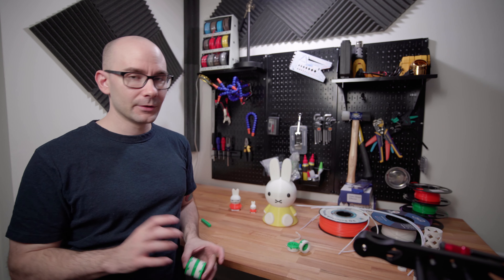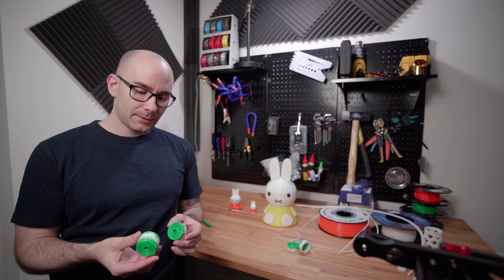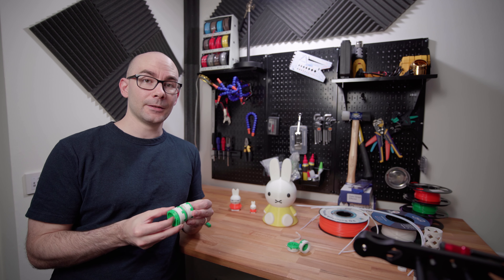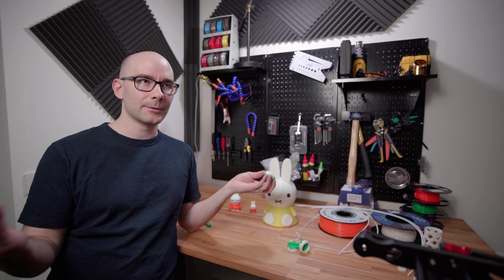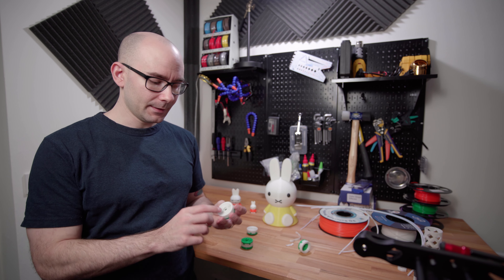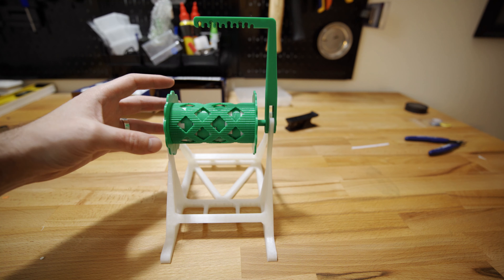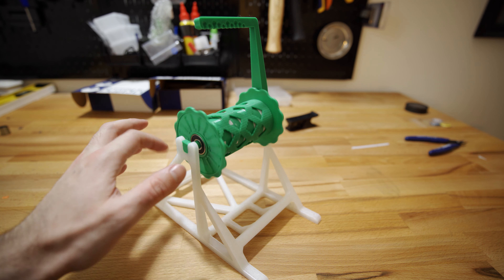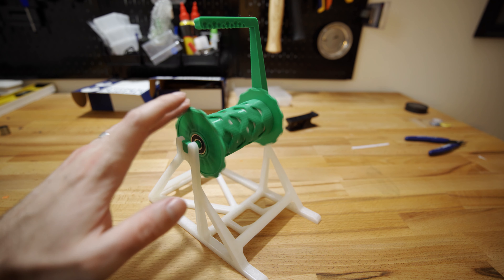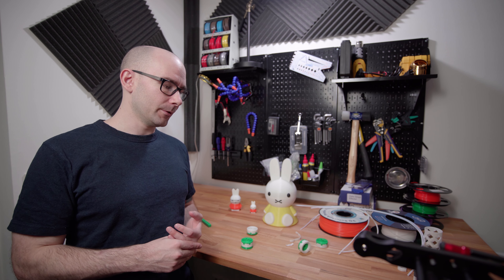Another thing I think is a guaranteed must if you're going to print with this are the auto-rewind spools. I printed mine in PLA, and a lot of people recommended in the comments to print it in PETG. Being traditional George fashion, I didn't listen to anyone, and I regretted that because I'm going to have to reprint them all in PETG since a couple ended up breaking. It's a little spring made out of PLA that causes tension as it unspools — the weight of the spool makes it rotate and unspin as it's unwinding. It keeps everything nice and tidy and just reduces another variable of error for your prints.